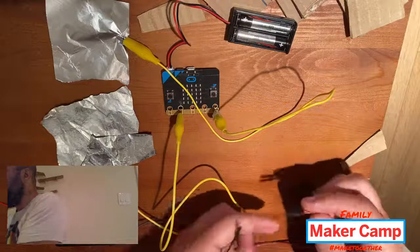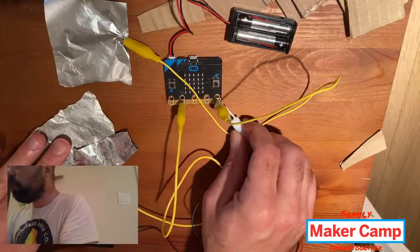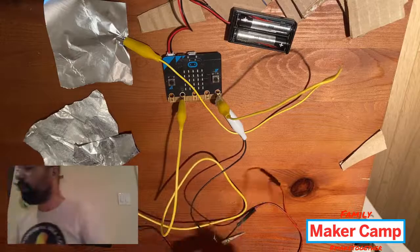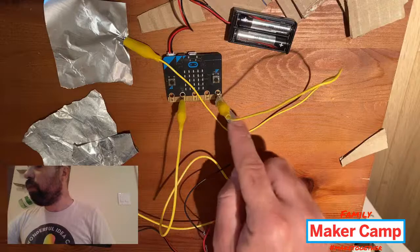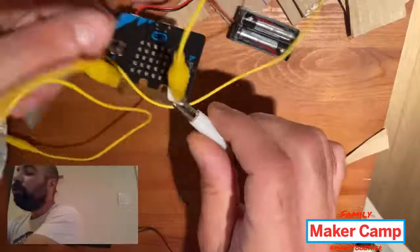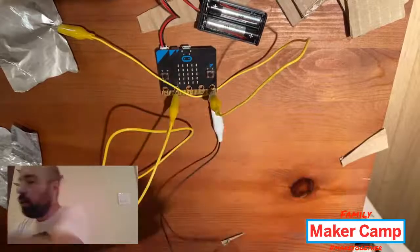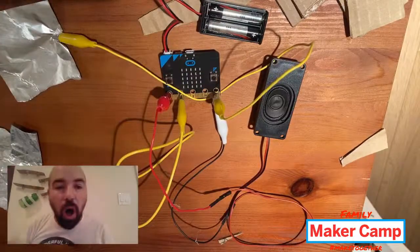If you've experimented with micro:bits before, let us know what you've done in the chat — there are so many different possibilities. I've attached one alligator clip with a black wire also to ground. There's only one ground position on the micro:bit, so I had to attach two clips to ground — I'm clipping one horizontally and the other one down. Then for the red side of the speaker, I'm going to attach that to pin zero on the micro:bit. The speaker on the micro:bit always has to go to pin zero — that's just how it's programmed.